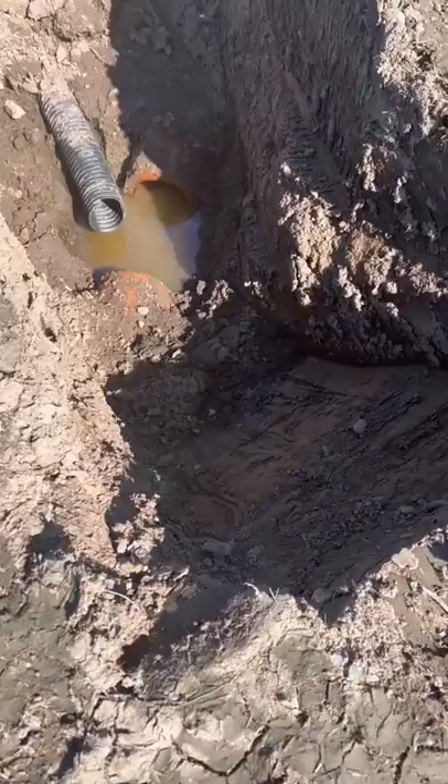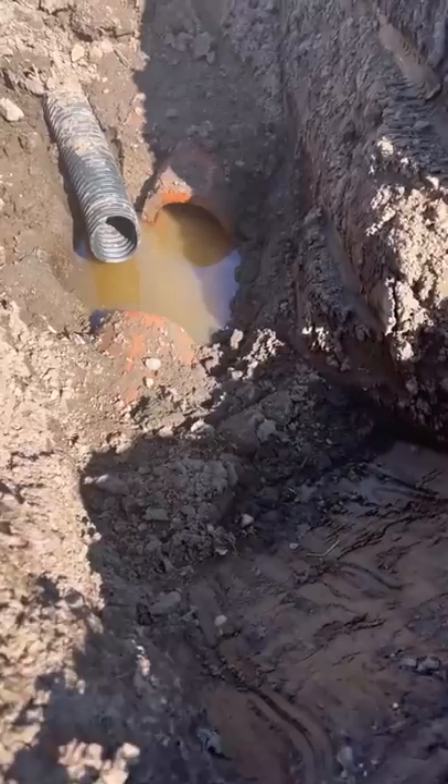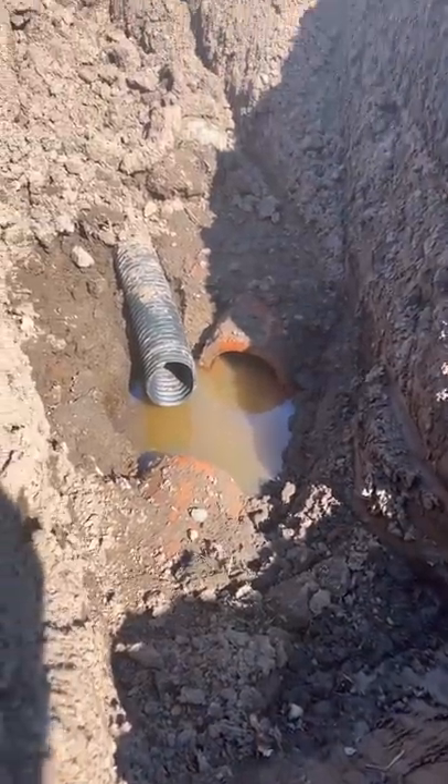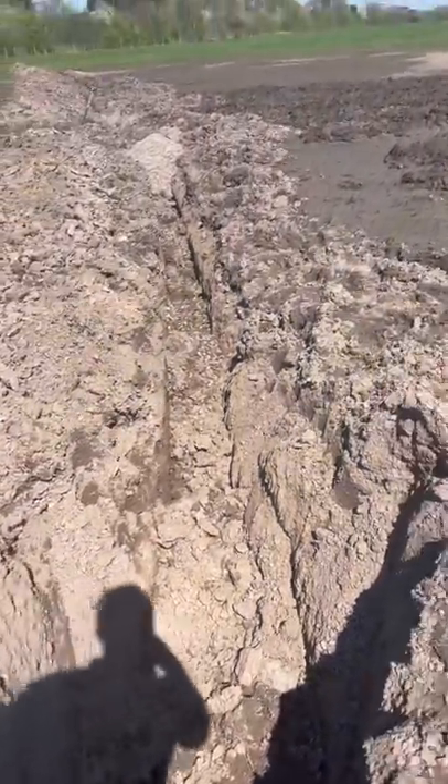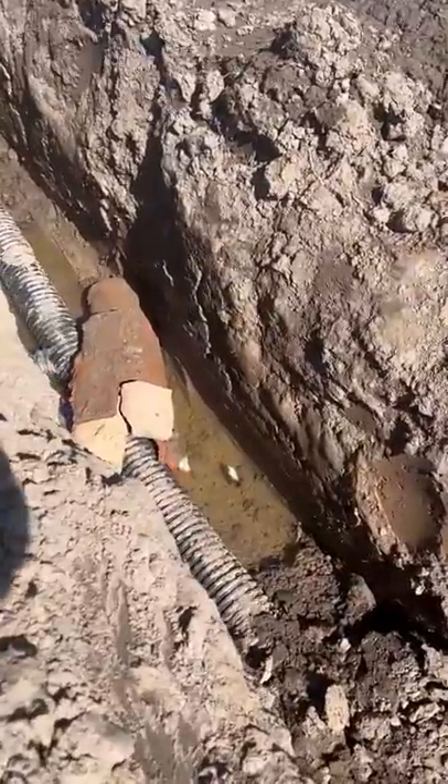Morning all. As you can see, we have a huge wet spot in this big field, so this is how we cure it. We dig a trench and put the four-inch plastic pipe in. That was a six-inch tile which is absolutely huge, put in the 1960s.